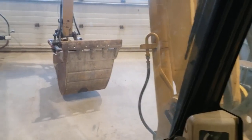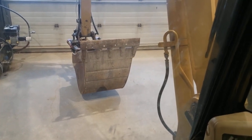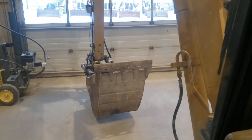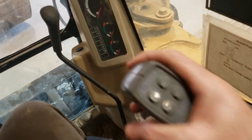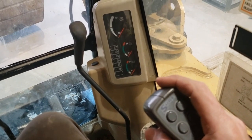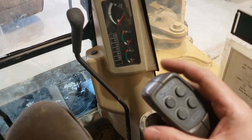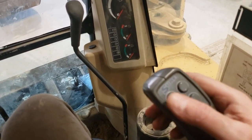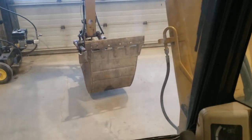Still no dice. This machine is not as simple hydraulically as our forklift. On this machine — and again there's no standard here — I'd have to consult the service literature to find out that it has what's known as an accumulator in the system, and this is pilot or servo controlled hydraulics. You may have a combination of controls in a machine: some functions that are mechanically controlled like our forklift had, other functions that are pilot or servo controlled like this boom function, and you might also have some electro-hydraulic functions. I can see some buttons for a rototilt attachment on the front of the machine — that's electro-hydraulically controlled.